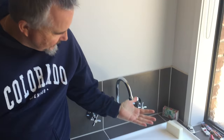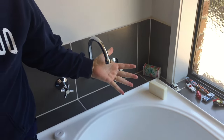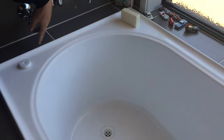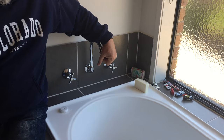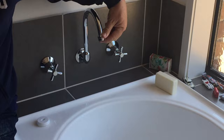What we've got here is a dripping tap. See that? It's just constantly dripping. Most likely what's happened is that a washer has given away. You can see it's been dripping and made a bit of a mess down around here. So we need to pull the washers off. There are washers behind both of these taps, and the water dripping out is cold — it's not hot — so it's probably a cold water washer. But we'll pull them both out and have a look.